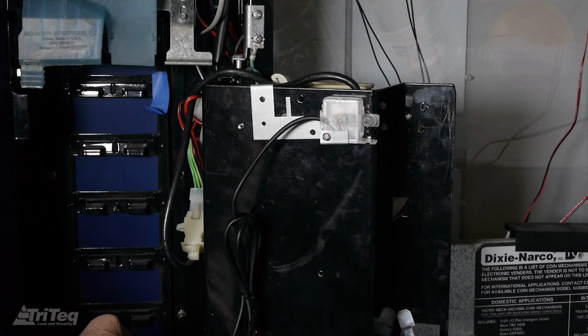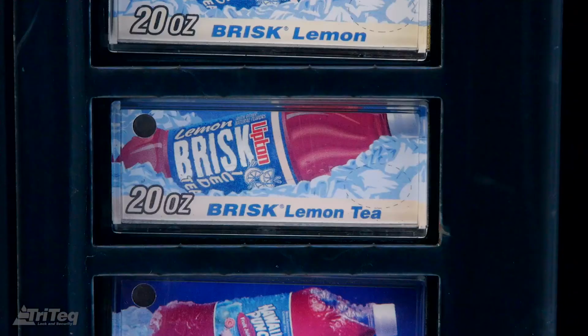As shown, the receiver is attached to the frame of the vendor holding the coin acceptor. After swinging the coin acceptor door back to the closed position, the receiver will face into the rear of the selection buttons so the key can be pointed into the button to operate. Note that the button label must be a non-black, transparent color for the infrared signal of the key to operate.